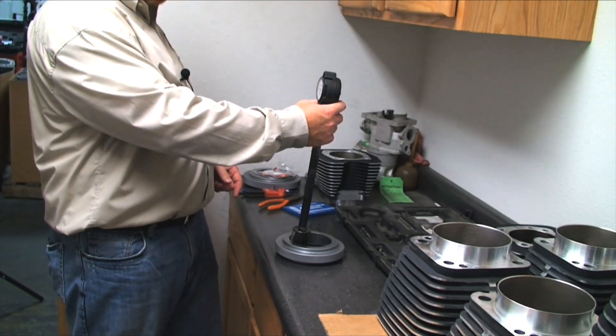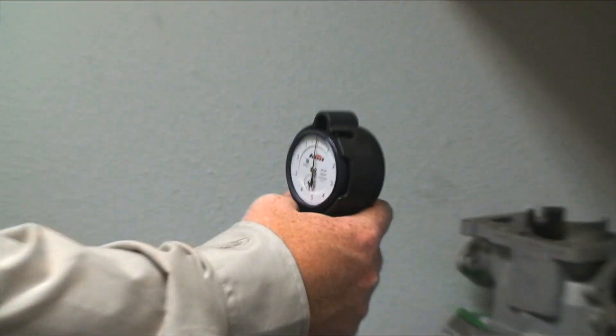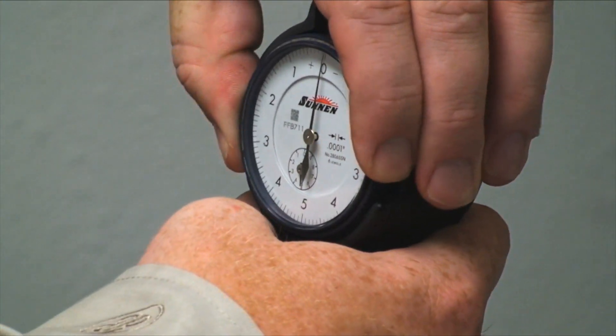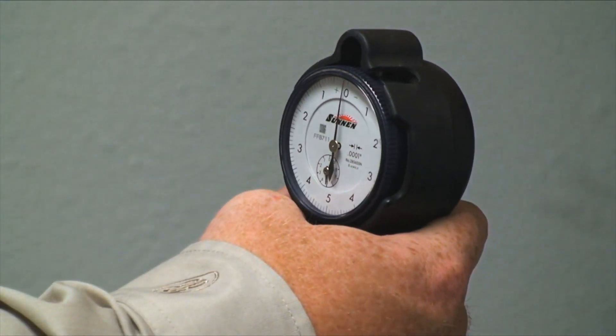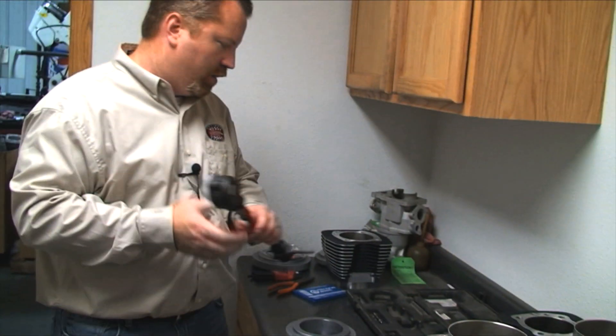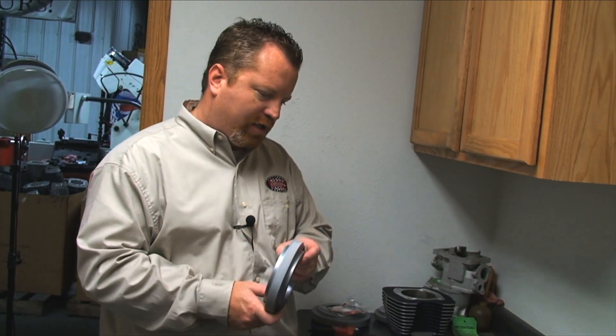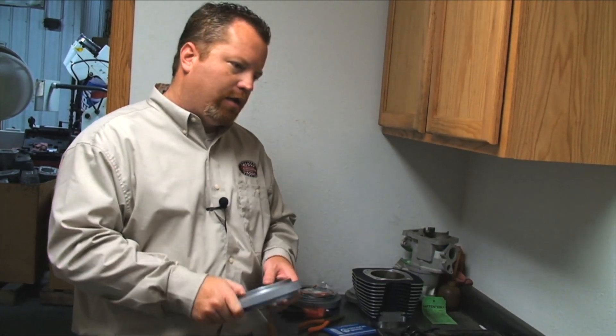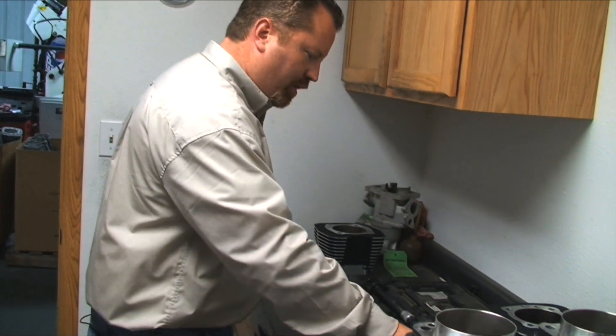The gauge should always reach zero in the gauge ring. As you can see this one has moved a tenth, so you always have to readjust it and make sure you're right back on zero — that's important. Have consistent sizes over and over again. We have a number of these gauge rings here to ensure our sizes are always right, because everyone can measure differently and it's important that you're as accurate as possible.